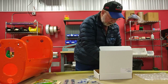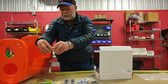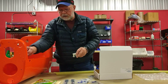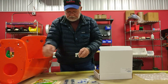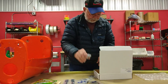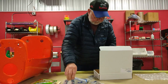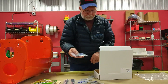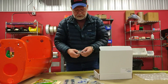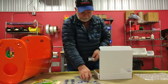Now here's that handy-dandy invention of Doug Keller's. It slips in here and then you screw this precision-headed bolt through that hole you reamed on the inside, and that clamps this thing tightly — and that's where you drill your locator hole for the hinge point. Very precise instrument. Here's the aforementioned reamer that comes with every kit. All the drill bits you will need in different sizes. Allen wrench you will need.